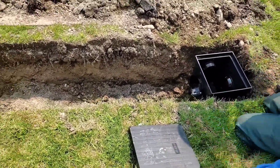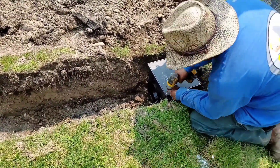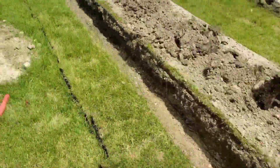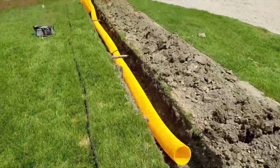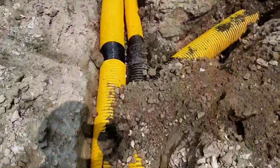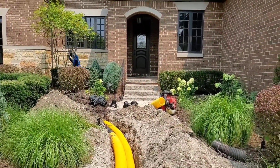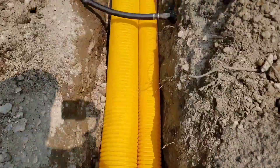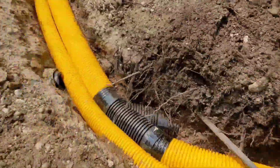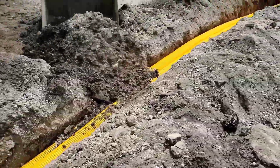I'm going to show you how to prep this before you do concrete or brick pavers — and perhaps you're going to leave it stone. This is a D-box and Valente's getting it ready for the six-inch pipe that's going to come down here. There are a couple different tricks when it comes to these D-boxes. Those 12-by-12s take a six-inch pipe — that's what's nice, and not every D-box does. A D-box stands for distribution box. We have our six-inch big virgin yellow pipe for the sump pump discharge, and four-inch that runs to the six-inch main for the roof runoff.